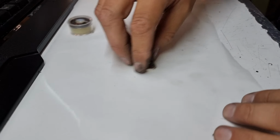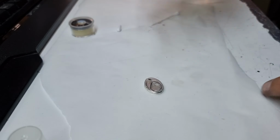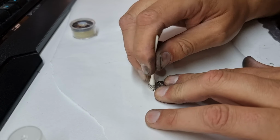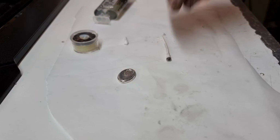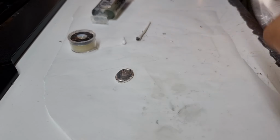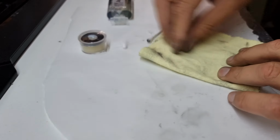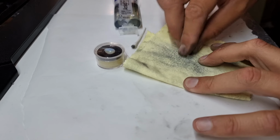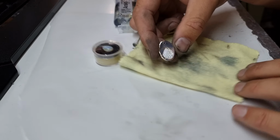So we're back again, and we're in the office, the desk, the workshop. I've got to develop official names for these. I'm using a bit of isopropyl alcohol here that helps dissolve the wax and stuff that I use in the buffing compound. Before I get going with the epoxy, I'm going to hit it up with a silver cloth first, to get the maximum shine, because it gets to be very difficult to get a shine on the front once that gem's in there. Geez, it makes a difference. Look at that. That's looking more professional now.